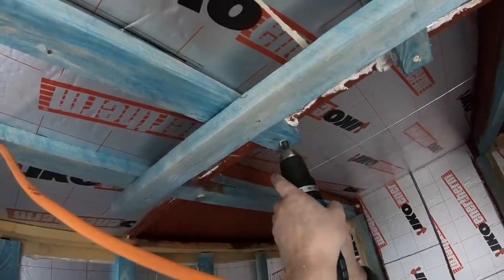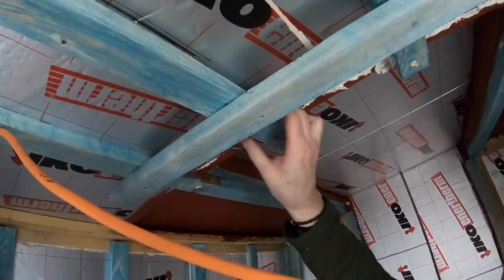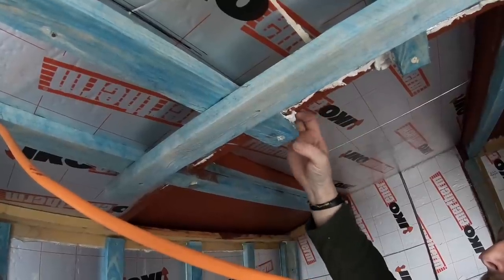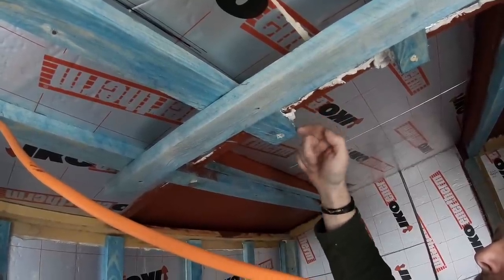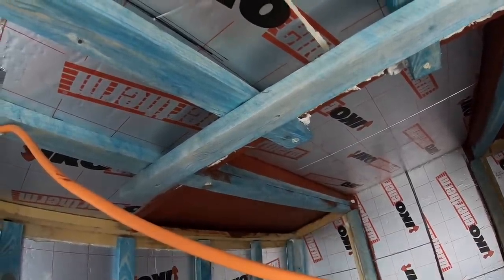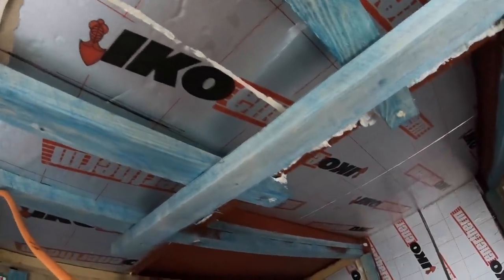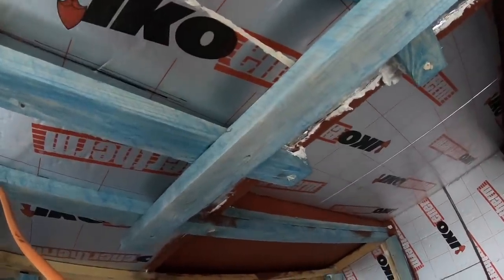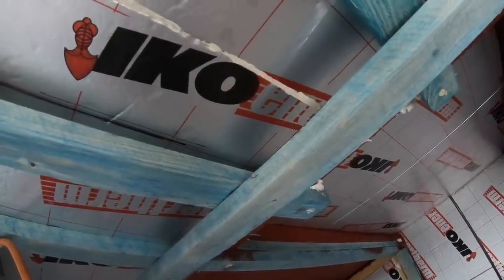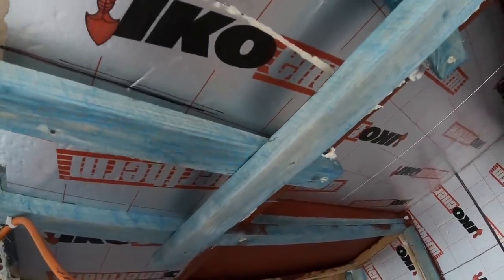Wondering why we're countersinking this, it's because the wood is 25mm or 1 inch thick, and that rib is 25mm or 1 inch thick, so we've got 50mm or 2 inches of thickness there. But the screws we've been using to screw into the steel, they can get them with 50s but with a hexagon head on, but we wanted to use the sort of countersink heads, and you can only get those in a certain length, so they're either too long or a little bit too short, so we're using a countersink in it to get them into the steel.